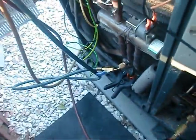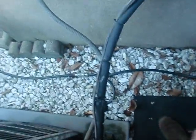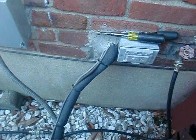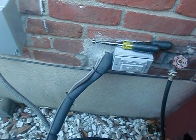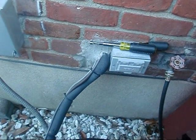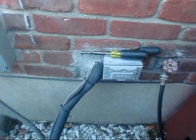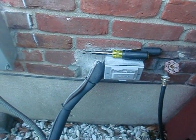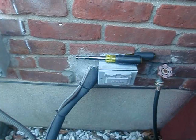This is what they call the true suction valve. So basically in this mode — we're in the cooling mode — basically there's a column of liquid shooting back to the indoor coil in there. And it's hitting that TXV and it's basically like an injector, shooting a mist in there. And it's going through there, absorbing the heat — that's where you're getting your cooling from.